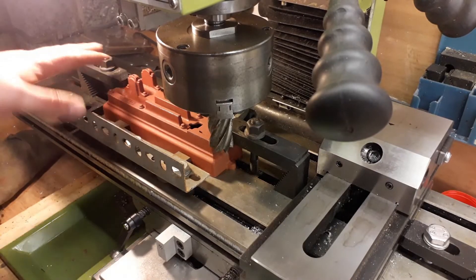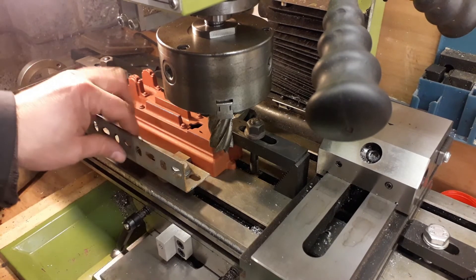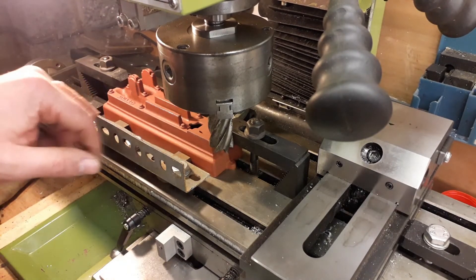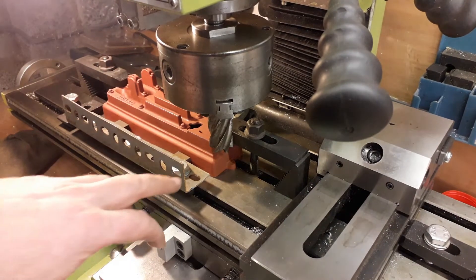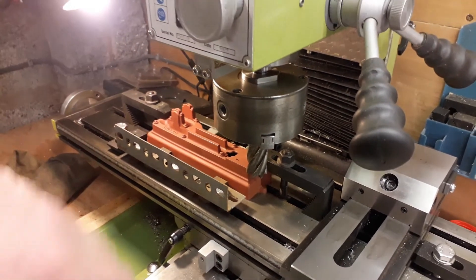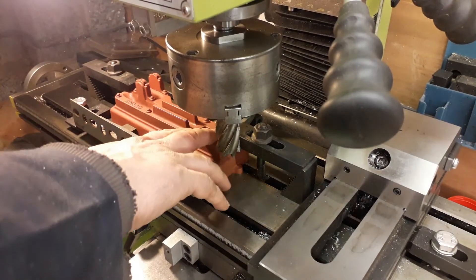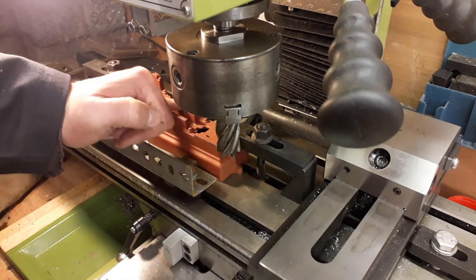What we'll do now is flip this over onto the milling machine and show you how we set it up and clamped it. I've clamped a couple of pieces of scrap bar using a bit of Dexion shelving as a register for it to sit against, then I clamp at this end. I can leave those set in there as a reference point — I can put the casting back in and it's in exactly the same place every time. I've lined it up and put a dial gauge on the front edge so we know we're parallel. I dropped the tool down to touch the table and zeroed the DRO, so we can come up an inch and a half to machine the first part where the cylinder goes, then come up that extra 21/64ths to machine the slide rails.